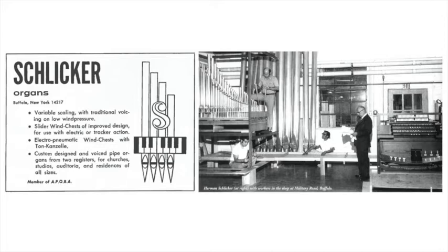This pipe here has just been put on the table, and it doesn't make any sound, as you can hear. By looking at this pipe, everything seems to be fairly straight, but the one thing wrong with this pipe is that the languid is too high. In other words, it has to be lowered. So we do that by tapping it very gently on my head. And then we blow it by mouth, just to check ourselves. Speaks fairly well.